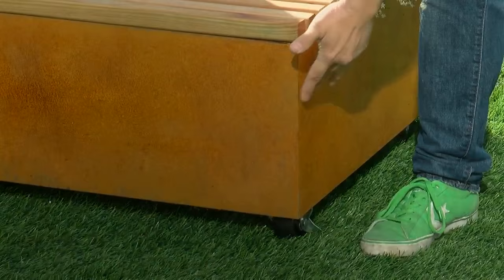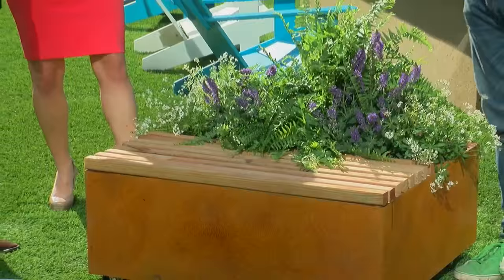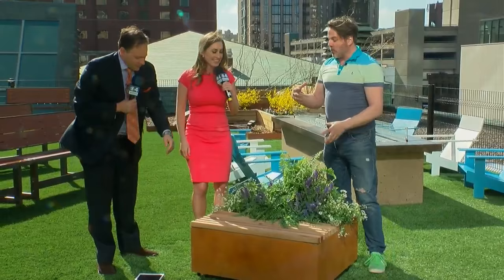Just so people understand, this is the metal — that's the metal of the file cabinet. It looks like kind of patinated metal or wood, like rusted Corten steel, which is my inspiration. You remove all the paint that used to be on the metal cabinet. And then a little trick I use for raw steel is I add vinegar on it — I just spray on vinegar. And it goes to work immediately, within hours. That fast. It's not a daylong process or two days — right away. And that's something safe to try, since it's vinegar, not a chemical, so it's easy for a lot of people.